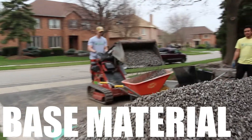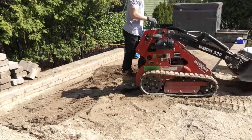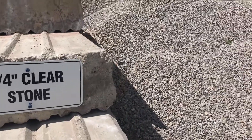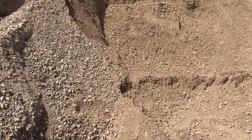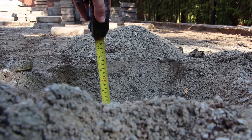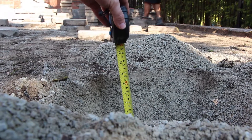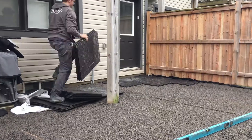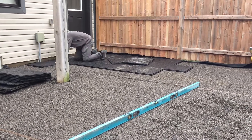Number one is the base material. The base material is extremely crucial to the longevity of your project, and that's no different with polymeric sand. If you are not using a three-quarter inch clear open grade aggregate, a quarter inch clear open aggregate for the bedding layer, or a three-quarter inch down to fines gravel for your base material with a quarter inch bedding layer or a concrete sand bedding layer — and if you're deciding to use stone dust that doesn't allow water to drain freely through it — you will see failure in your polymeric sand. That stone dust will allow water to remain underneath your pavers, and when polymeric sand is activated, it needs to cure from the bottom up. That water underneath your pavers will prevent the polymeric sand from curing, leading to failure.